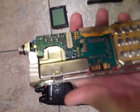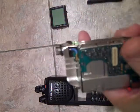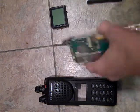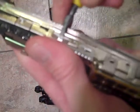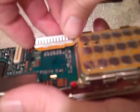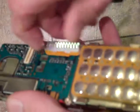So, you've got two clips. Use a small screwdriver to do this. Yeah, that's the right size. The clips ride on a channel. You gently pry upwards on them. And these clips will fit in a groove that is in the controller board. Be very gentle with this. It takes a little bit of working out because of the way these are in.